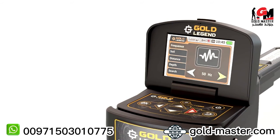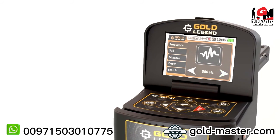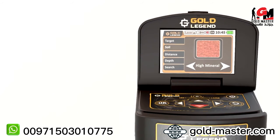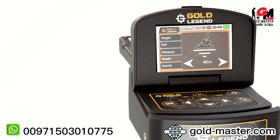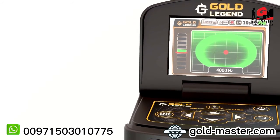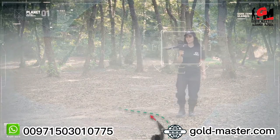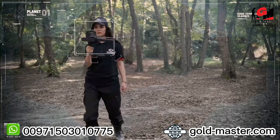Here we can customize the frequency value we want accurately, instead of choosing the target type from the automatic list as in the long-range system. We complete the remaining settings, such as the soil type, the maximum distance and depth of the desired target, as in the long-range system. And start the search according to the zigzag path also mentioned in the long-range system.